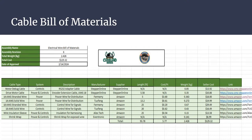That's great. Then we have the cable bill of materials. So this is a pretty quick one. We're going to be using 14 gauge, 18 gauge, and 12 gauge, which we're hoping will be either donated or provided by a sponsor, because we only need the 12 gauge for the wire going from the battery system to the distribution hub, because that's where all our current is going to be summing, is through that battery.